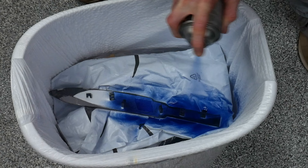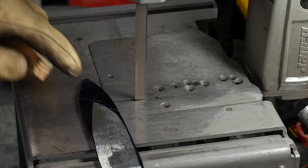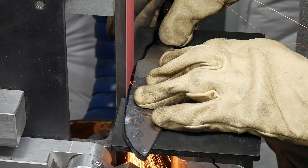After looking over my blank, I ended up drawing out a smaller blade than I forged, so I'll have to do some reduction here. I put my template on the forged blank, sprayed on some marking fluid, and cut the bulk of the excess material away on the bandsaw. I then set up my work rest at 90 degrees and clean up the profile on the 2x72.